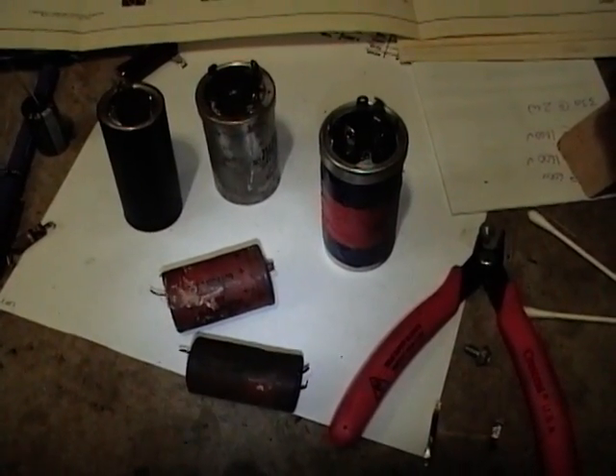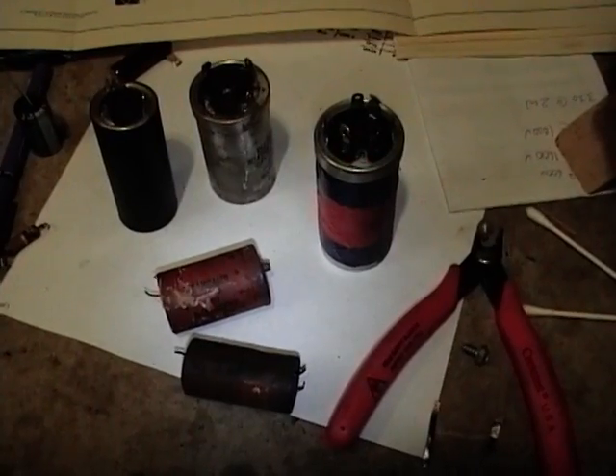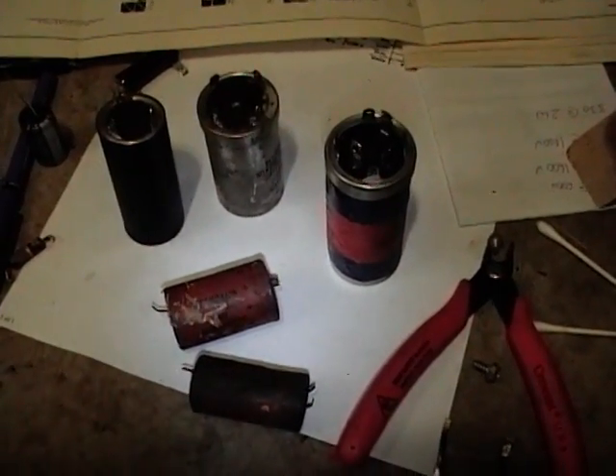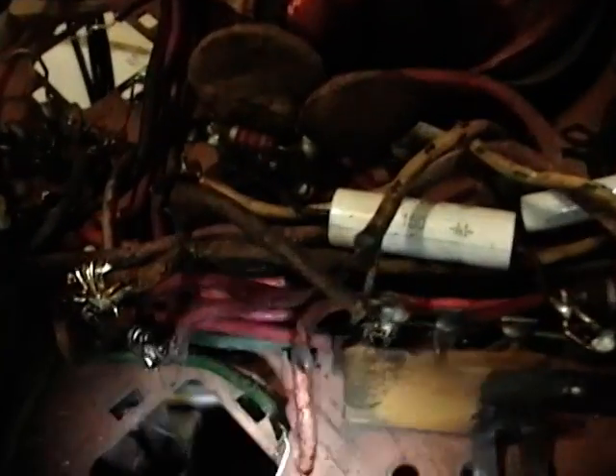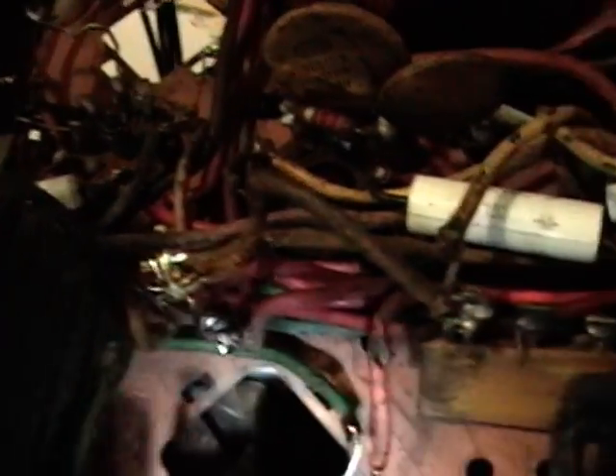I've removed all the old electrolytic capacitors and now I'm going to be restuffing them. It turns out that at least one of them isn't quite so old though — I could tell it's a replacement from the way it was soldered in. Here are the old connections and there are remains of a capacitor lug underneath those wires. What the repairman did was cut off the lugs from the original electrolytic capacitor and then soldered them onto the replacement with a big glob of solder. All I had to do was heat up the lug and these just slid right off. The twist lock tabs — only one of them was actually soldered on, so I was happy to find that came out fairly easily.